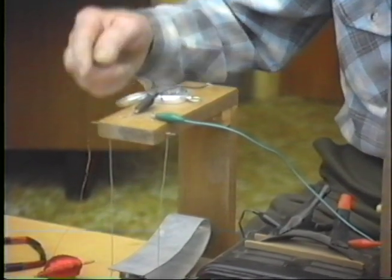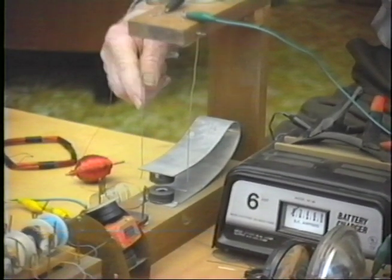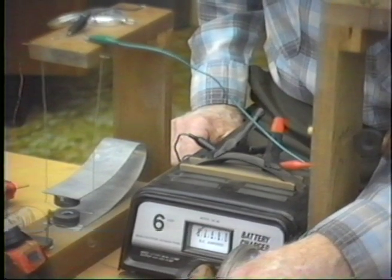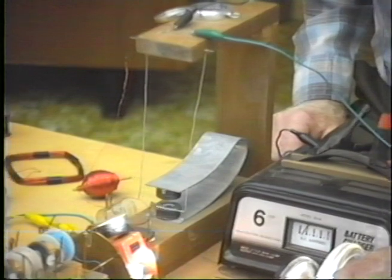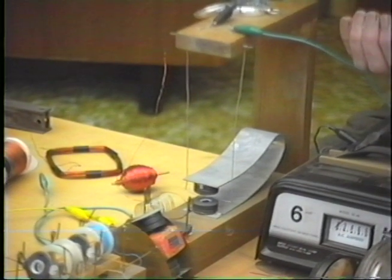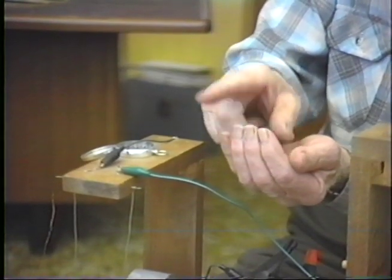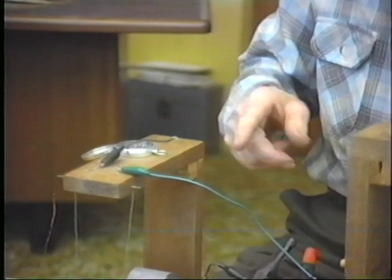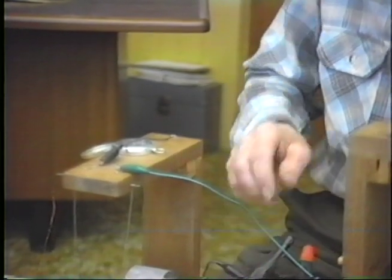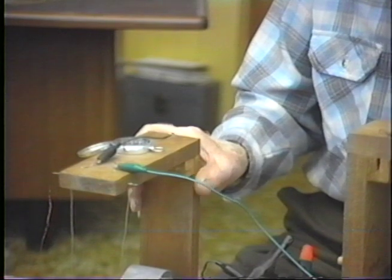When the current goes down through here between the magnets, you have a circular field all the way around this circuit. When it gets between the magnets, if we push the switch, it'll show the wire out like that. That's because the circular field doesn't want to stay in between that straight magnetic field. If you pull two magnets apart, you have a kind of straight magnetic field in there, and as you put the circular field in there, it reinforces it on one side and cancels on the other side, so it kicks the conductor out. That's the whole principle of the electric motor — the rejection of the circular field from the straight magnetic field. There are many forms of magnets — electromagnets, permanent magnets — but it all works on the same principle.